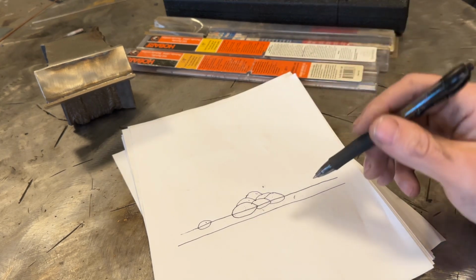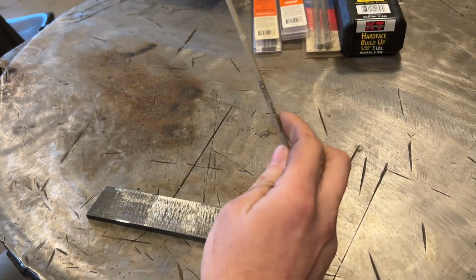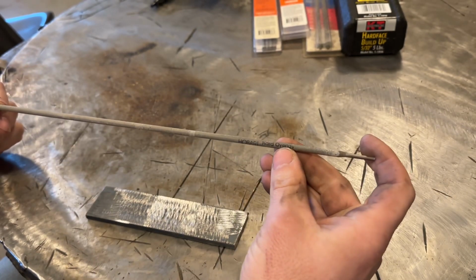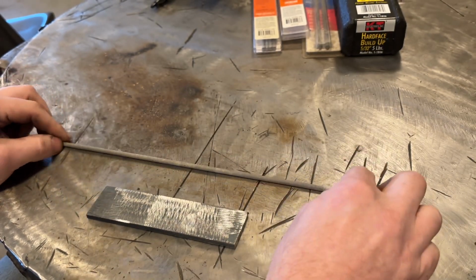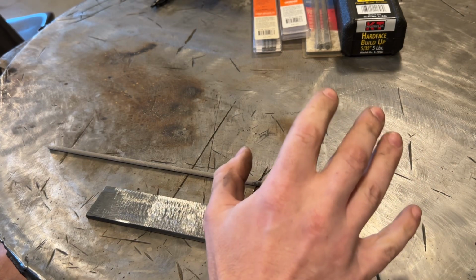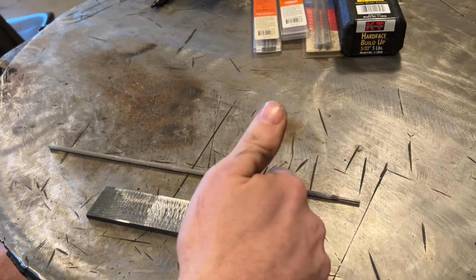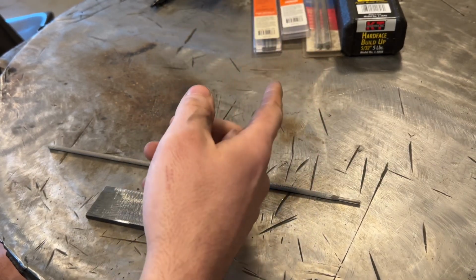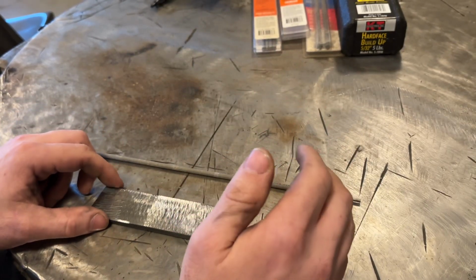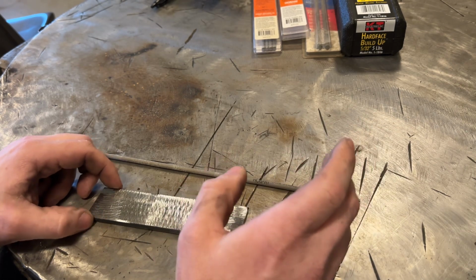Okay, so let's talk about how to actually weld with these. I have a Hobart rod here in front of us, and this is hard overlay. These are not spec'd like a 7018 or anything like that. Most of the rods that you're going to run into are just purpose labeled. So this is hard overlay. Those over there, the KTs, say hard face buildup, so no spec. There may be an AWS specification for some of them, but I don't have any of those.